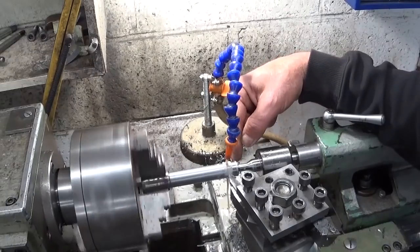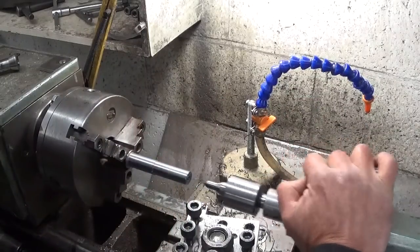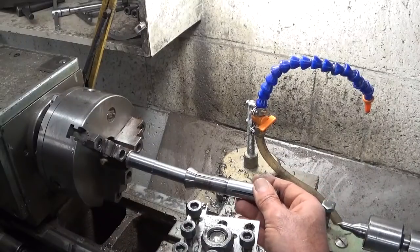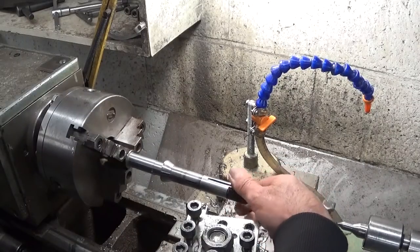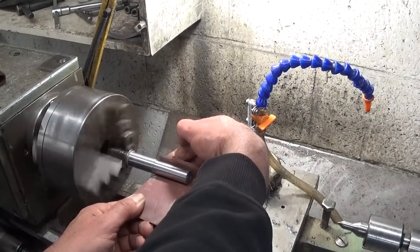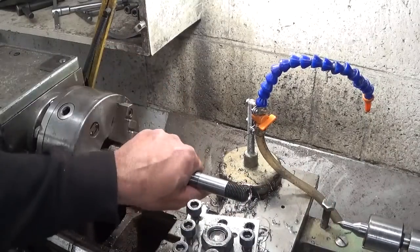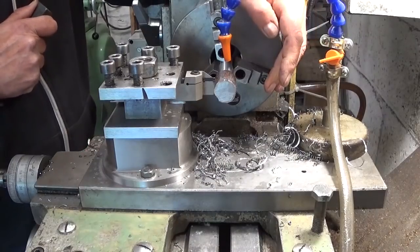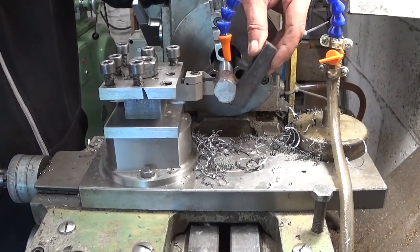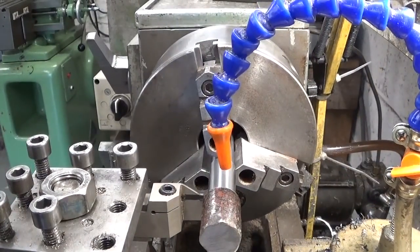When I look here it looks promising. My collet should fit on here. Yes, it's a little bit snug. That's better. I flip the part around in the lathe and I'm going to cut it off so I have a nice little length to bolt this part on.